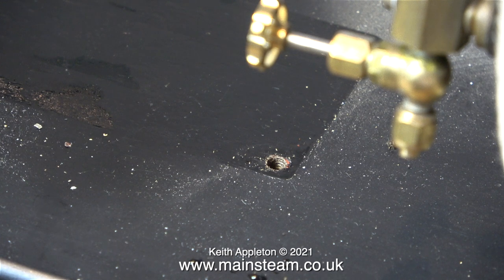Things like the water tank and the gas tank were fitted to the hardwood base by using 5BA bolts threaded into the wood. This is a throwback to my days of building model aircraft, and it works very well. After cutting the thread in the baseboard using a normal tap, if you want to harden the thread, use some very thin super glue in the hole. Make sure it is fully set though before you fix the bolt in place.